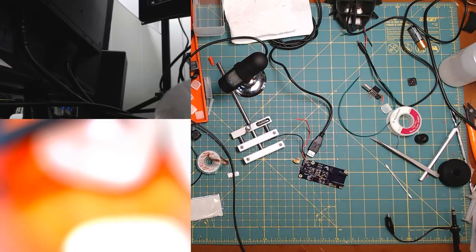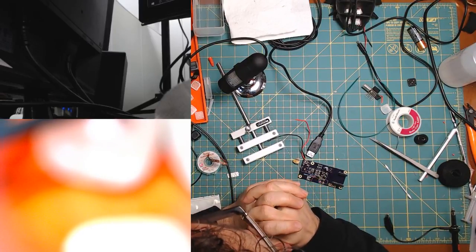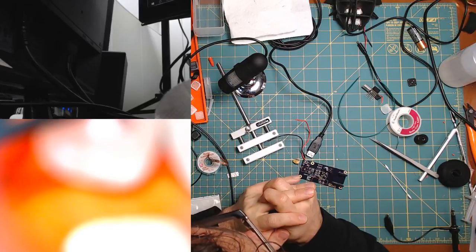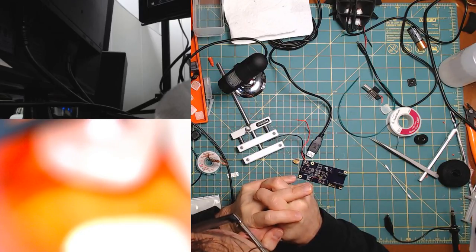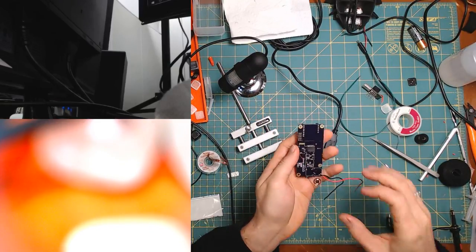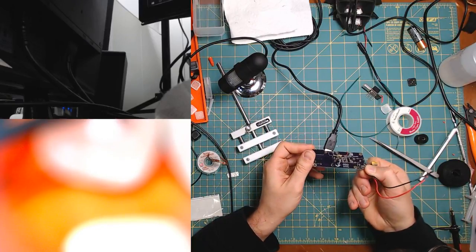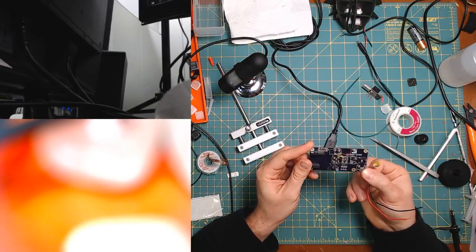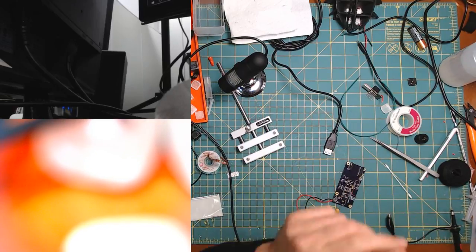Heated it. Oh, sorry. I guess I also can check the regulator with our beep thingy. Yep. Just check its output. Although when the whole thing is shorted, you'd never know. Yeah, exactly. But I really doubt it's the regulator, to be honest. It is easy enough to desolder, but it looks clean. So, LEDs.